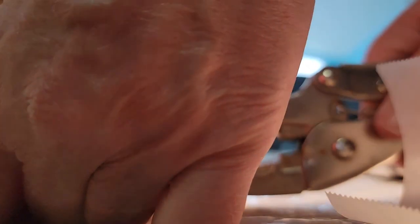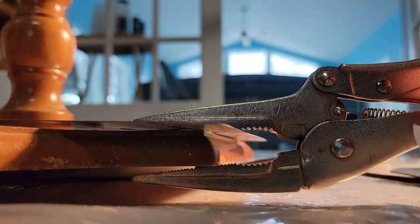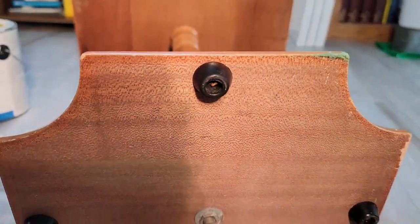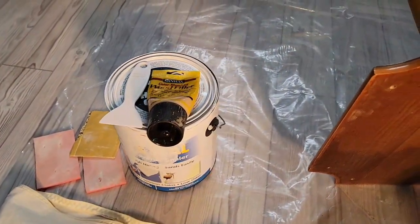What I did was put a piece of metal over it and then use some vise grips, and I had to actually torque the vise grips up just a little bit to keep some direct pressure on that area to hold it down. Here was the bottom's problem. It had four little buttons on the bottom, so basically it spun around like a top. It needed eight of them at the bottom.